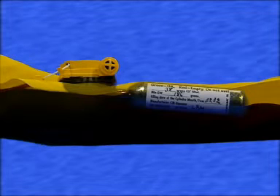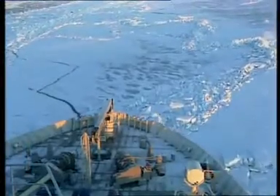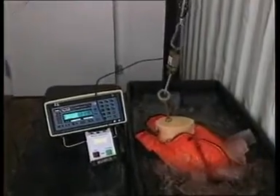Hammer has also placed the gas cylinder inside the bladder, to give protection against humidity and water, as corroding cylinders on life jacket cylinders is a well-known problem in the business. The protective position of the cylinder adds to effective inflation even in extreme temperatures. We focused the testing on the most severe situations, exposing the unit to a lot of water, water spray, and even wave splashes, to verify that it was well protected against inadvertent inflations.